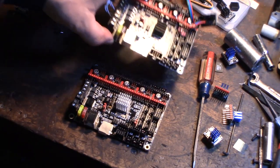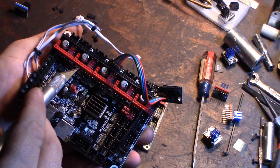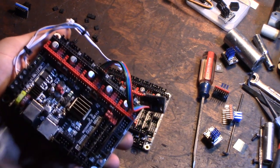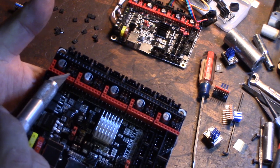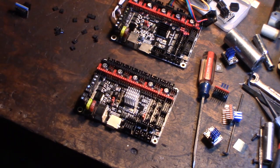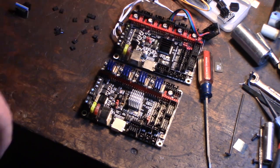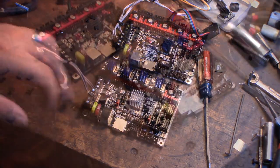The UART setup is a little different between the SKR 1.3 and 1.4 boards. On the 1.3 you set UART mode or SPI mode with specific jumpers, but on the 1.4 you just leave one jumper on there and that sets UART mode, which allows Marlin to communicate with the drivers directly via serial protocol. Also, if you're wondering where the manual is for this board, look under the SKR 1.3 section on GitHub — for some reason the SKR 1.4 manual is in the 1.3 GitHub repository.